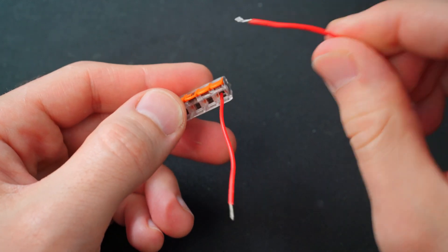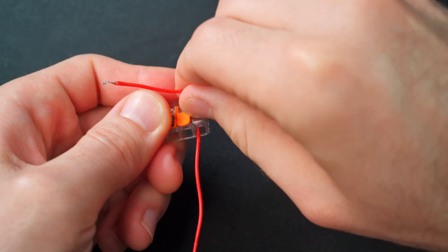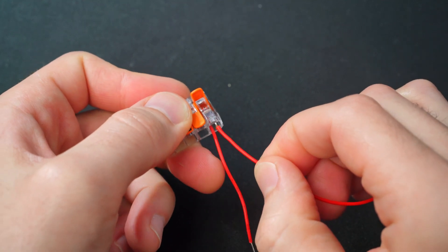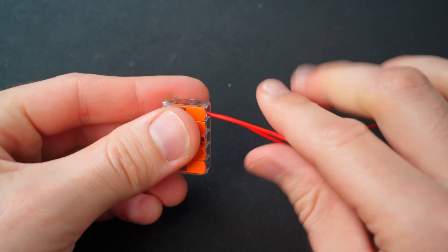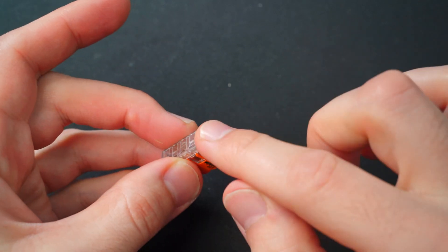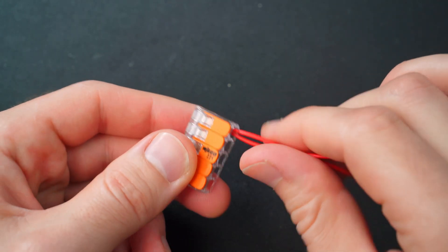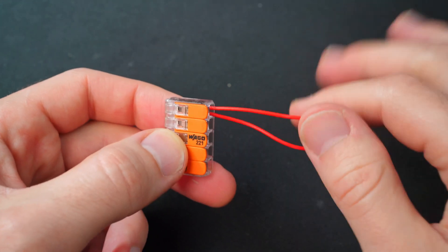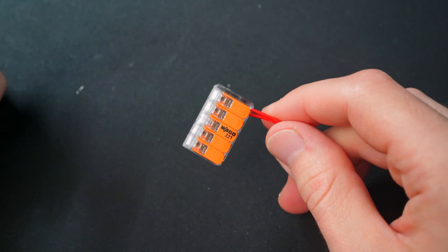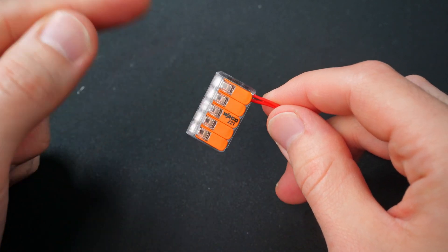For guitar wire, this hole is big enough for two or even three wires. Open up the latch, put another wire in, close down the latch — and now you've got two wires conducting. This is great for when you need to put the ground and the bare wire from the pickup into one single slot. I've even put four wires into one hole and it holds them securely. This works great for ground wires because everything inside is conducting with each other.